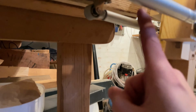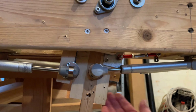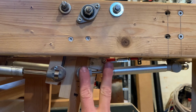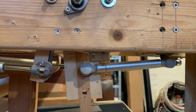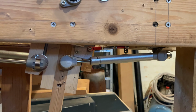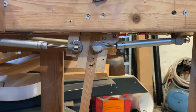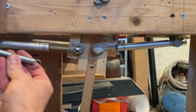And on the opposite side, you can see a damper right there. Now this is mirrored, so what's going on here is also going on here, and what's going on over here is going on here. But I'll get back to this one in a second. So this damper is just restricting how fast you can move the yoke, and it is also restricting the movement so you have the right angle. Getting this back in place at these 8 degrees, I used springs. I had a spring connected from here to here and in the other direction.